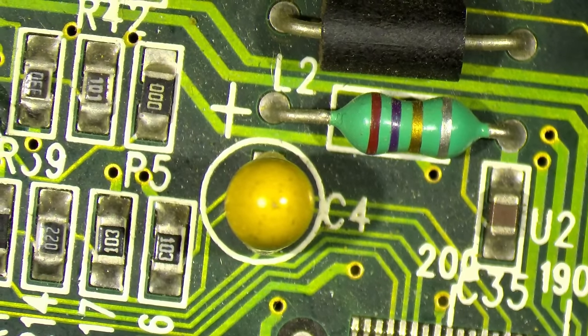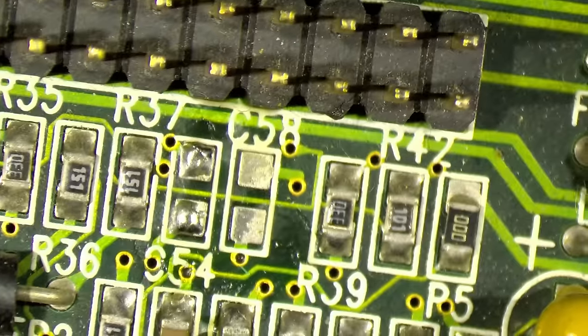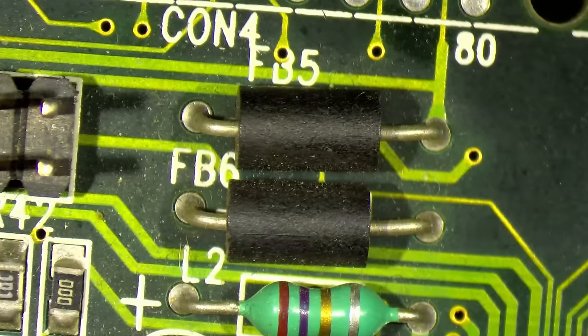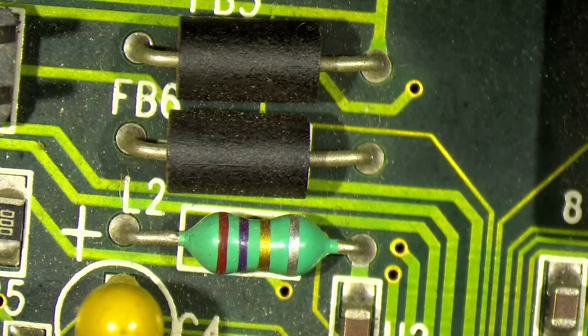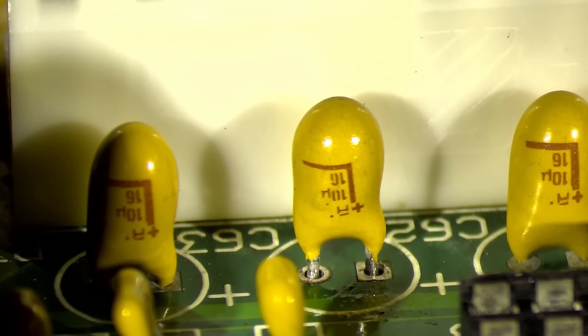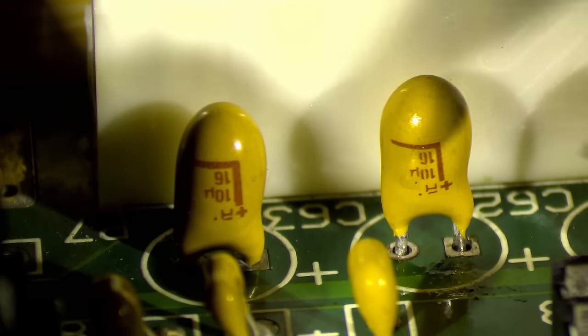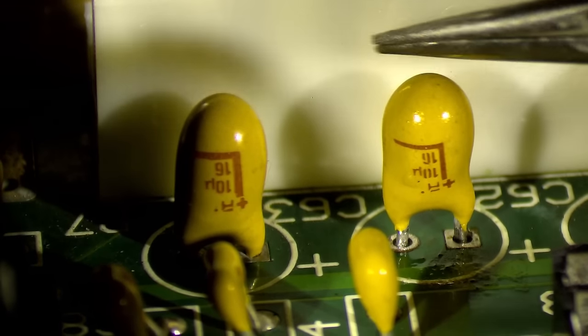And what am I going to use for a replacement? This is a Trident TGUI 9440 AGI. I have plenty of those, and I already borrowed some components off of this card. So this is a donor card. It doesn't work properly, so I'm not wasting a completely fine card. But this card has exactly the tantalum capacitor ratings that I need. What do you think? Will somebody ever know that there was a capacitor that just blew up? I think it's even the same marking on it. Just a little bit different, but it has the same design.